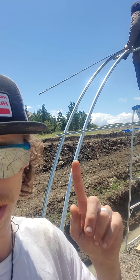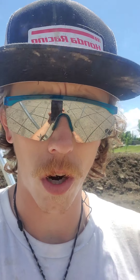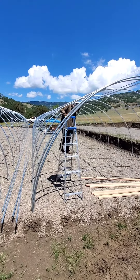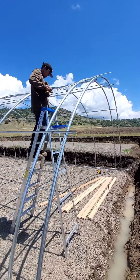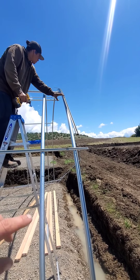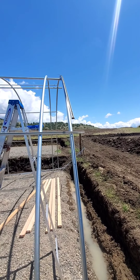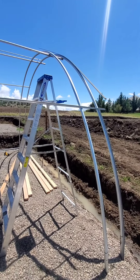Right now, Jesse's getting ready to put this channel on this bent hoop on the end. So this is a straight piece — it's actually aluminum channel. What we're doing is Jesse's about to bend this aluminum onto the hoop. It's very malleable and you want to put a tech screw every 12 inches — that's just my opinion. There's no right or wrong way to do this, but definitely some easier ways.